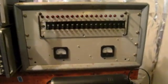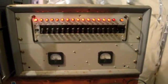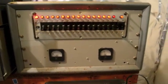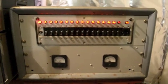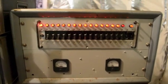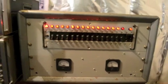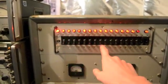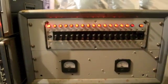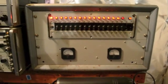The cool thing about this panel is that it's very handy when you move a lot. You need a lot of outlets in a basement laboratory like mine, but usually when you move into another basement there's only one outlet. This one uses a fairly long number 14 gauge power cord, and then we distribute all the power amongst these outlets. There's a main breaker at 10 or 12 amps and then these are each fused themselves, so it's actually quite a nice setup for a portable laboratory.